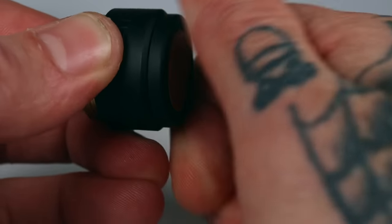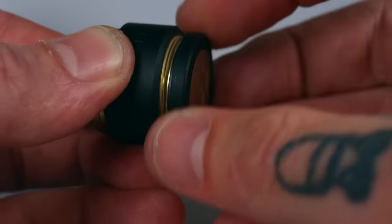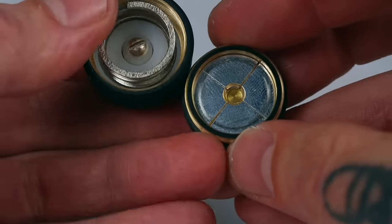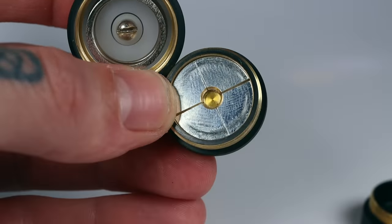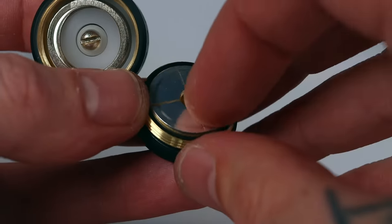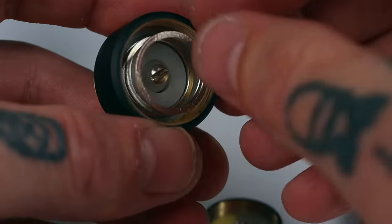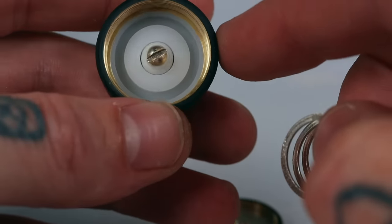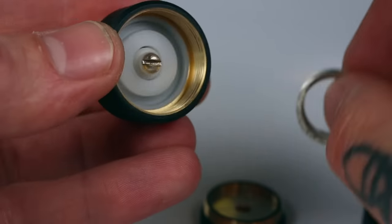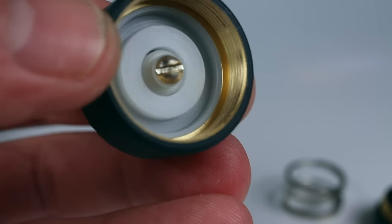Take it apart by unscrewing the base — very very nice seams there, you can't really see with the naked eye that there is a seam at all. Just like we saw on the Vert, you've got this clutch-style system borrowing from previous clutch buttons we've seen. It's got four segments in the base, a little brass plate that slides up and down with those four segments, and the spring in here to provide the tension. The spring doesn't carry any current because of the white Delrin plastic contact piece it sits in, so no hot button. As you push the button up from the bottom it makes contact with this nice ball-shaped contact here.